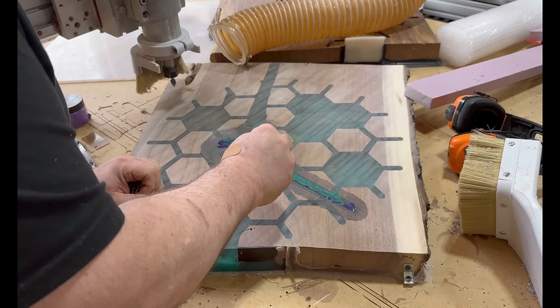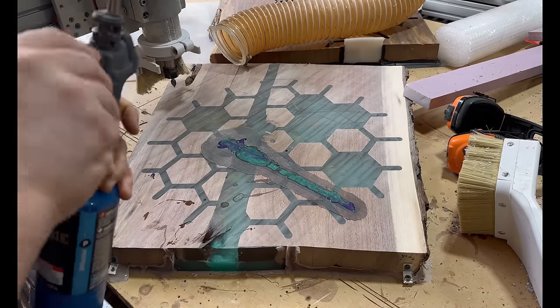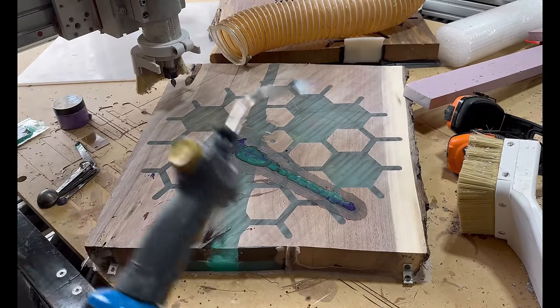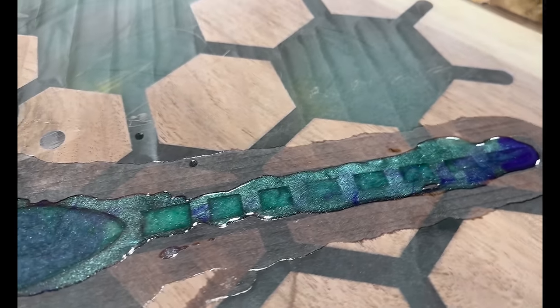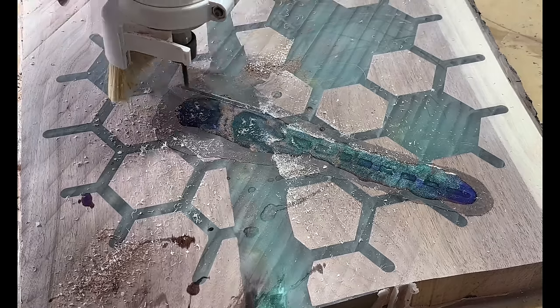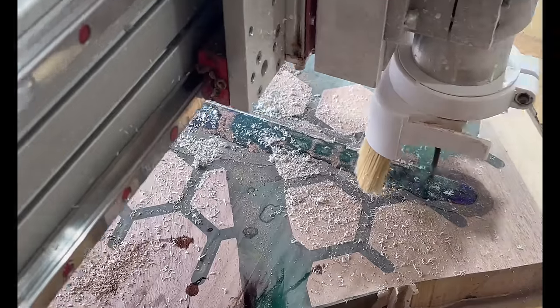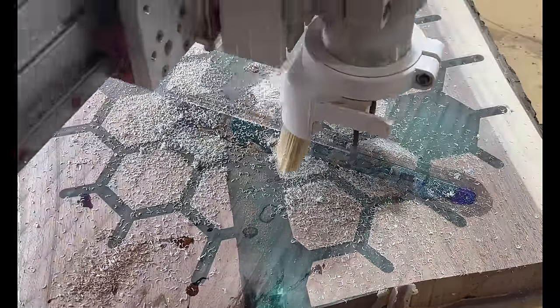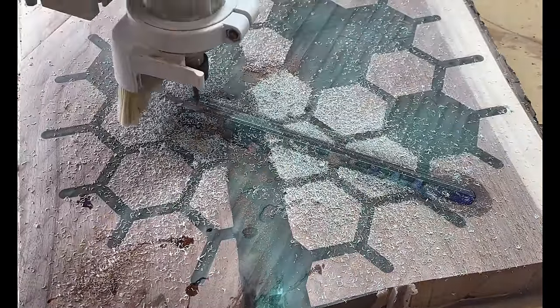But the problem there is this is wood that I just freshly flattened. So it's going to warp a little bit in certain directions, right? Little tiny bit, millimeter here, millimeter there. Nothing big. It's wood. It's supposed to move, right? Then there's differences in when you sand it, where you sand it, that wood that you're sanding over, and how hard it actually is. So it could have very easily ended up looking like crap. Doing it like this, I knew what I was going to get, and there was always a chance it could look like crap, but probably a lot less of a chance.